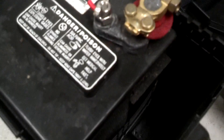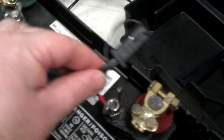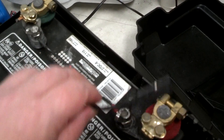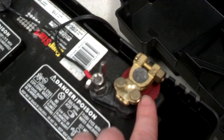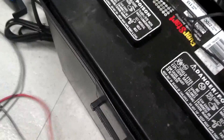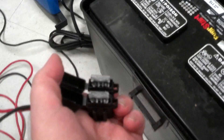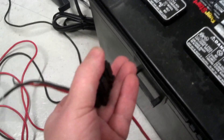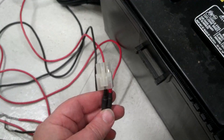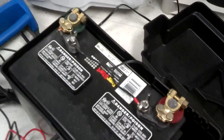That's what prompted me to get the pads to try to cut down on any corrosion. I bought these terminals — we already have the screw terminals on here. This is set up for a trickle charge system at some point, or I could use this as an output. I'm going to hook my radio power on here — it goes to fuses, dual fused 25 amps on the hot and ground — and then that goes to my amateur radio. I just need to get the charger leads on there and routed out of the box.